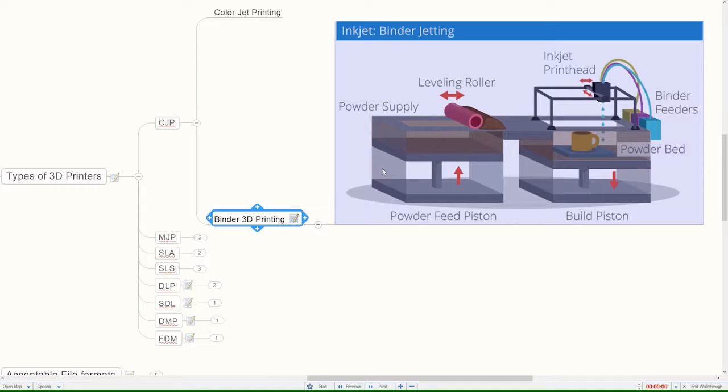So as you can see from this image, you're basically building a model based on binder applied via an inkjet cartridge on powder. Different feeder technologies exist, and this isn't typical for the latest printers, but basically we dump powder onto the build bed, spray binder in a pattern just like any inkjet printer, and the result is solidified powder where the model is placed in your printing bed. Like I said, this is one of my favorite technologies, and we have a printer in-house that I can show you, and I will show those in the office today, how that printer technology works.